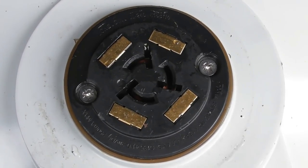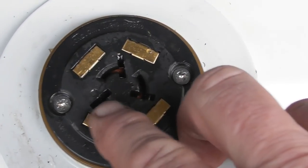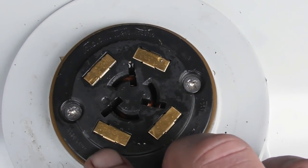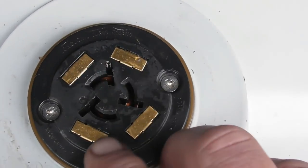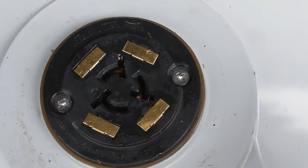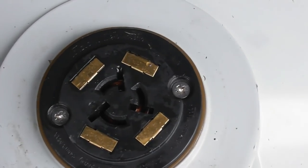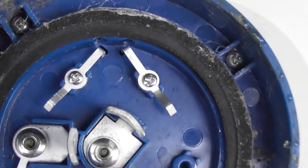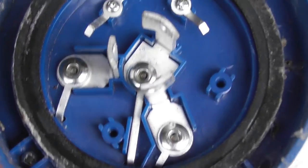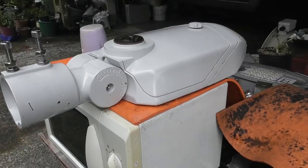By just going back to the adapter where the photocell fits in the street lamp itself, you have the three middle contacts that are being active and switched output and neutral, and then there's actually four spare contacts. In this case there's only two used, but there appears to be an option there. You can even use four of these contacts, and I think, not 100% sure, these have something to do with dimming. We've got these two extra contacts here, and I don't think there's spare contacts on the other side. Now we're going to open the device up and see what's in there, actually.